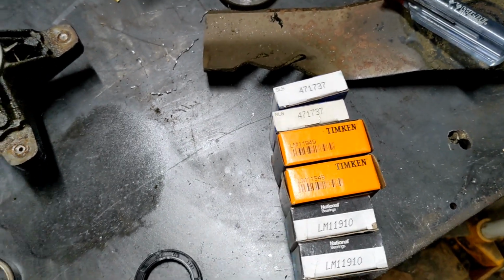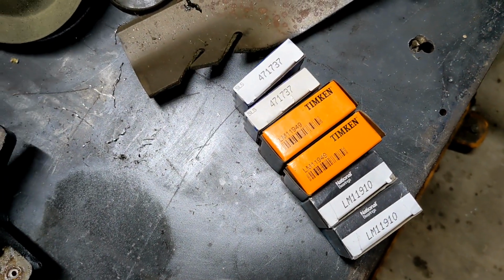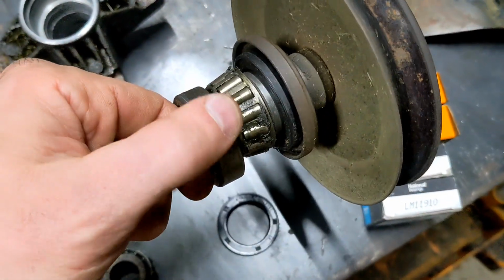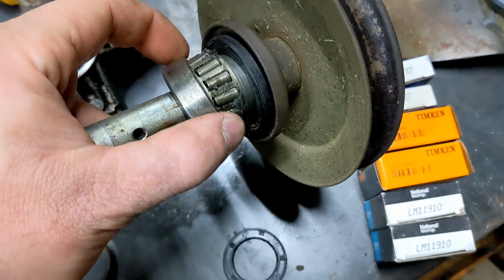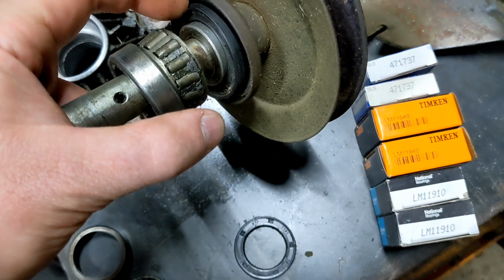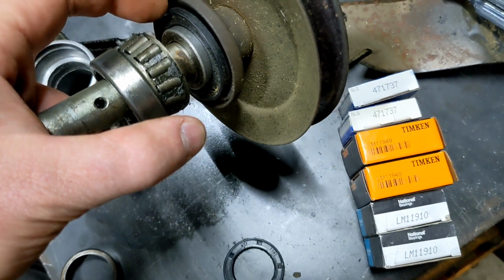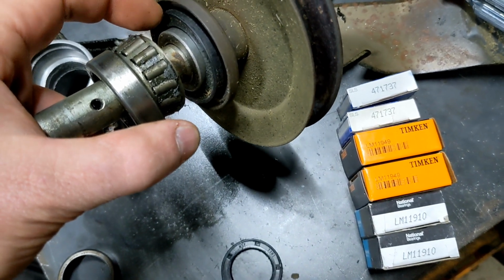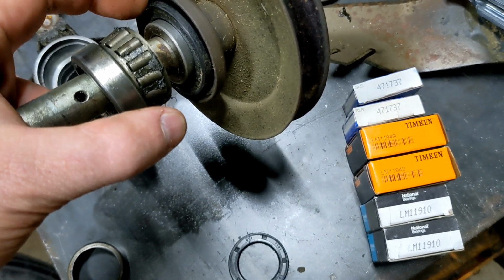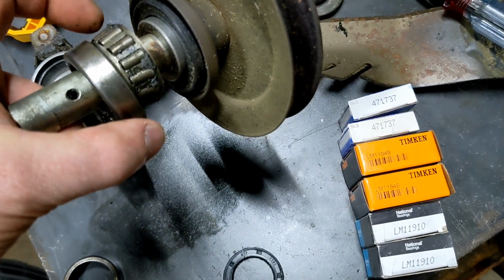What ends up happening with these is pretty simple, really. The issue is that you're mowing along and you catch something underneath the deck. I'm going to show you this one upside down because it's a little easier. So here's the race, the bearing. This is the seal, and notice how loose that is. That seal's not sealing anything being that loose. It's that loose because there was grass and strings and actually a piece of what looked like a grocery bag all wrapped up around there. Well, that stretches your seal, creates heat, distorts the seal, melts things, and then water enters your bearing.